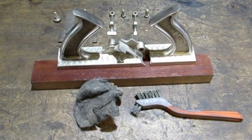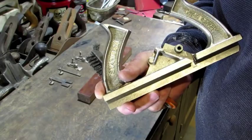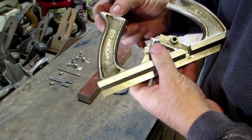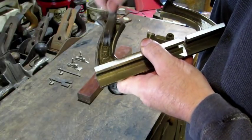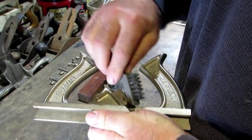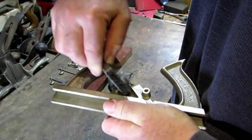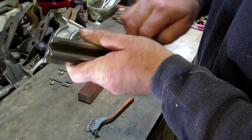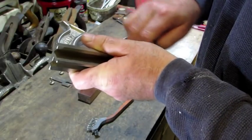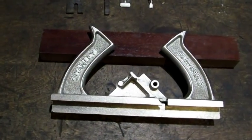Next I'm going to use the wire brush and some 4-aught steel wool to shine up the nickel plating again. The wire brush I'm going to use primarily to get down into the recessed portions of the handle and pretty much anywhere where there's some type of corner that it's hard to get my big fat fingers into when I use the steel wool. Then it's on to the 4-aught steel wool to lightly buff over top of all of the nickel plating. And that brightened her up just a bit.